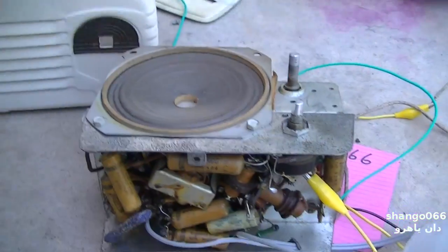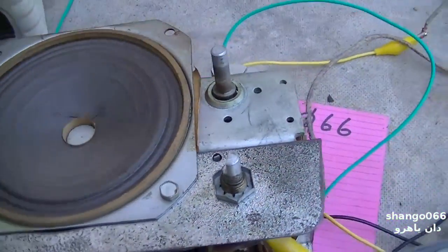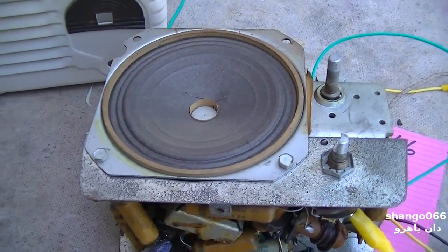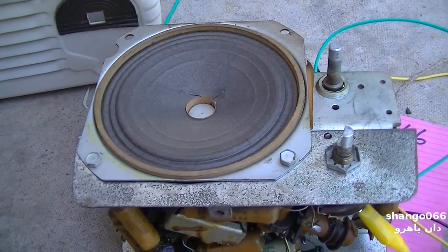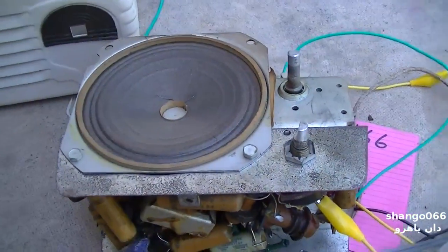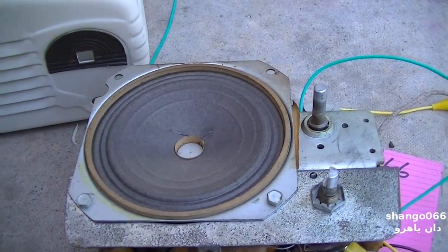You know, one problem I'm detecting with it is because it doesn't have a defined IF bandwidth, you can hear the digital sidebands of KNX, you can hear them riding on the sides, the shh.